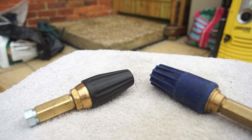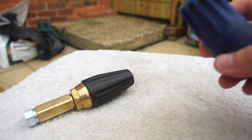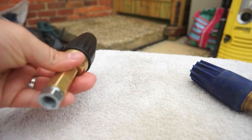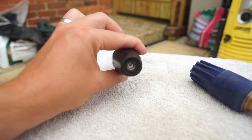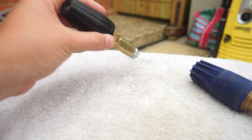They both work very well — very good quality turbo nozzles. They come in a wide range of nozzle sizes, starting around 030 up to about an 08. For my big washer I use an 065, and this one here is an 065. For a twin setup I run two 035 nozzles — you can see the little hole in the end where the water comes from.